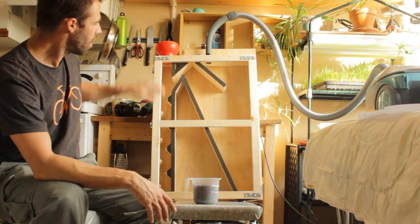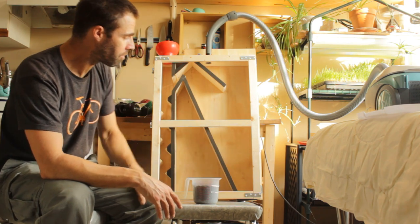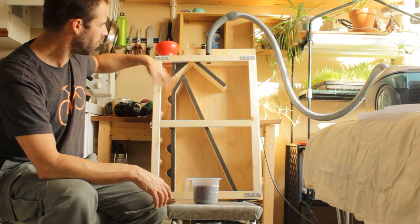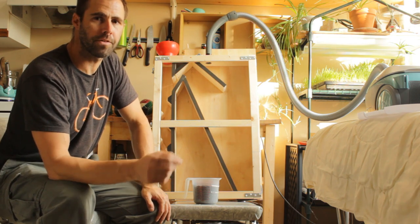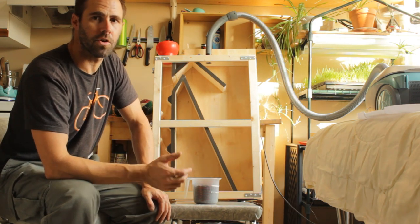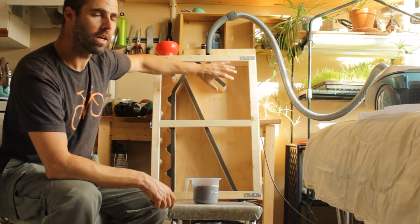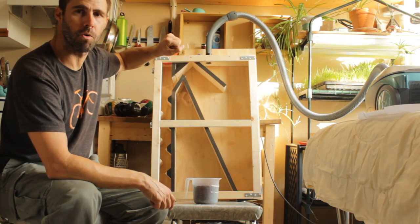What I'm going to do is use the suction so the heavier, better quality seed should fall through and the lighter seed should get sucked up. The greater the level of suction, the more seed is going to go through, so I'll start with fairly light suction and adjust. Right now I have a suction adjustment lever right on the vacuum. Other designs have another hole cut in the back with a door — as you open the door more, it reduces suction because it's drawing in air from a larger area.